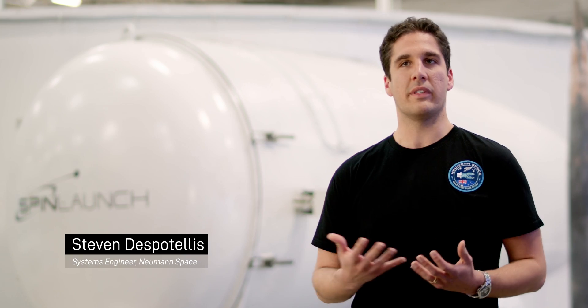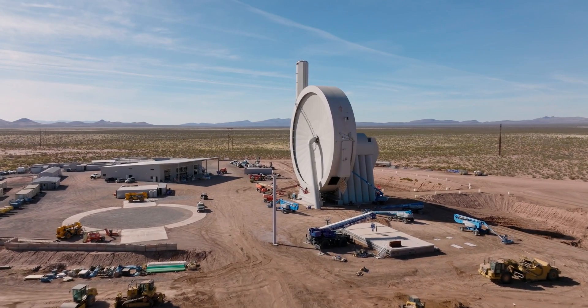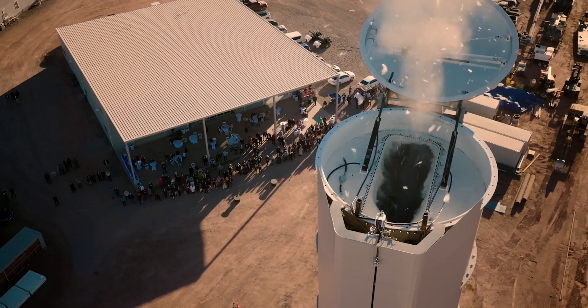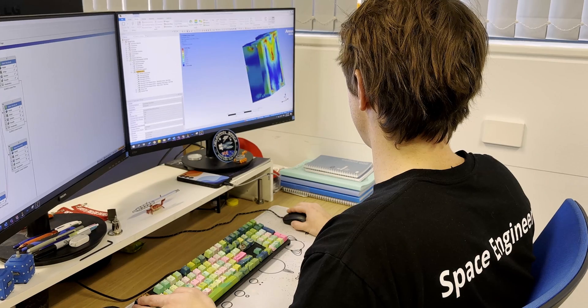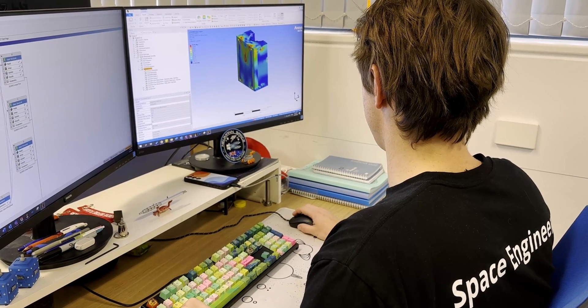When we first started the collaboration with SpinLaunch, we're dealing with a situation that as engineers we don't deal with very often — we're talking 10,000 g's here, and our system was not initially designed to take that. So we had to identify the areas of the design that were going to pose the most challenges in that environment and work out how to test them. To do that, we ran an ANSYS analysis on our existing design to identify those challenging areas, and from that we could work out where we had to implement some changes.